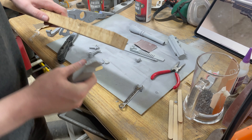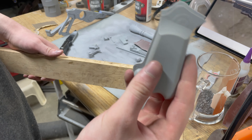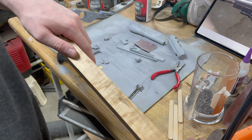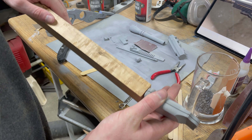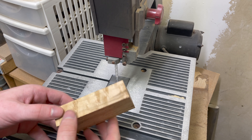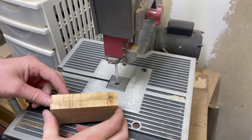While this cures, before I can paint anything, I'm going to start working on the handles. I printed these just as references — I want to do an actual wood handle. There's a piece of curly maple I happen to have that is just thick enough for both pieces. So I'm going to cut off a piece of this and start shaping. Got my chunk cut out, I'm going to cut it in half, trace the 3D printed parts, and cut out the basic shape on the band saw.